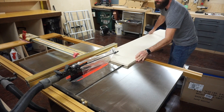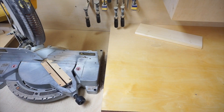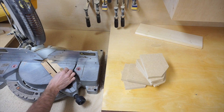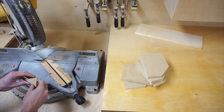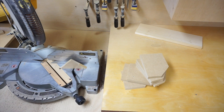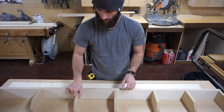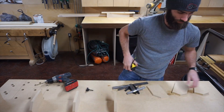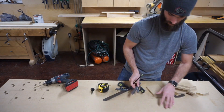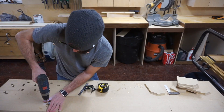I'm going to start the project off here ripping down some 3/4-inch plywood and a piece of MDF. The MDF is going to be the base and the plywood will be the fence. These are support blocks that will hold the plywood to the MDF in a 90-degree fashion. I've got the MDF piece down on the bench, then a 3/4-inch plywood which is the sub-fence, and then another piece of 3/4 that goes over the top and slides back and forth to give me a little correction if I'm not exactly at zero from my miter saw.